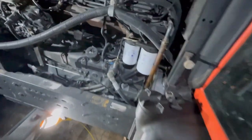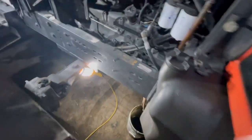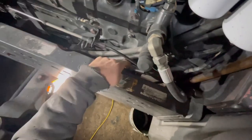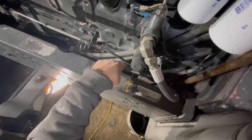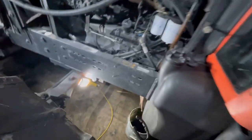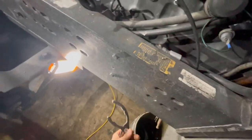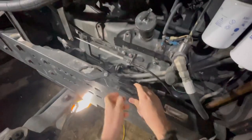Now we're back here working on the fuel filters. This tractor actually has three. You can kind of see it right there — that's the mount, the unit. It spins on from up underneath and it's got these two spin-ons right here. My regular filter wrench is not going to work — I don't have enough room. I've got to get my other filter wrench.